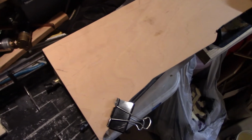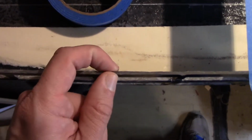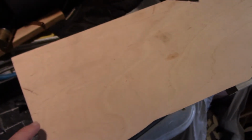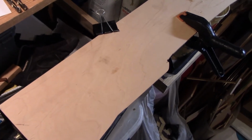Another thing you can do, once it's flipped over, is try to trace it on the inside, but you can see with the windows that could be pretty difficult. With this boat, it's really well made, so the thickness of the fiberglass is really uniform. So I can just take a representative measurement, and then I'll have the trace line, and then I'll do an offset of, I don't know, 1/8 of an inch or so, and that'll get me a ballpark when I cut this piece out and then fit it up with the hull.